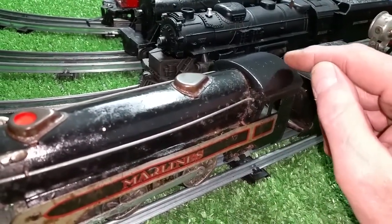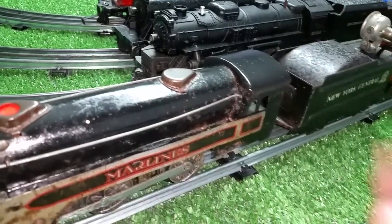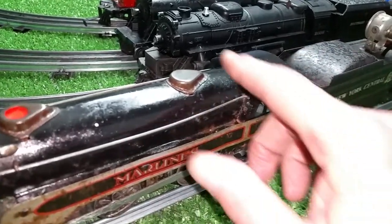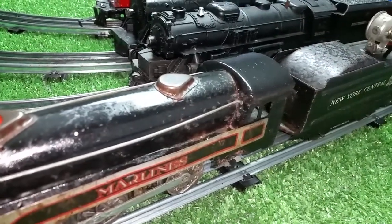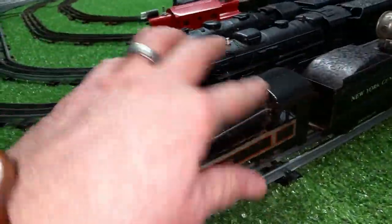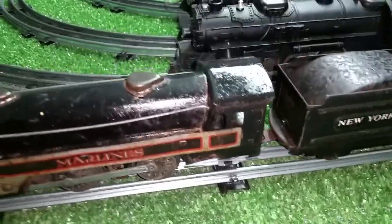You can still see there's lots of little divots and grooves left over by the rust. So what you do is basically strip the paint off and take a file and actually file this away — it would take you forever with sandpaper. But in any case, just do a quick touch-up: scrape the rust away. I just masked this off with a paper towel and then lightly misted it with black spray paint and then painted it with oil. And it made a dramatic improvement in how this looks.